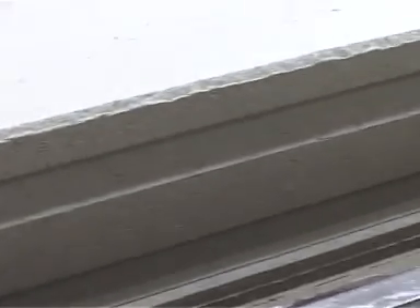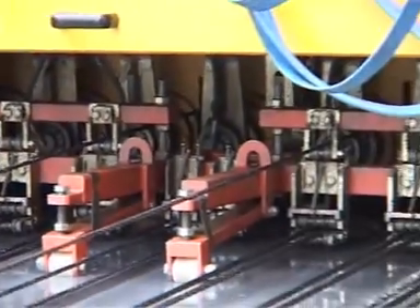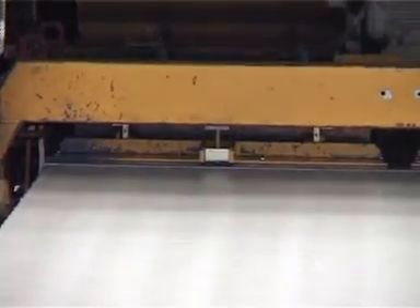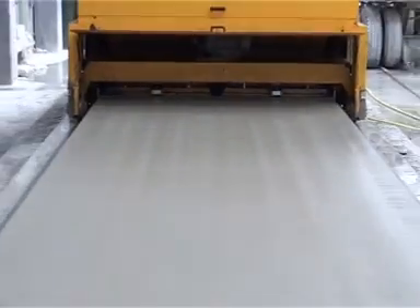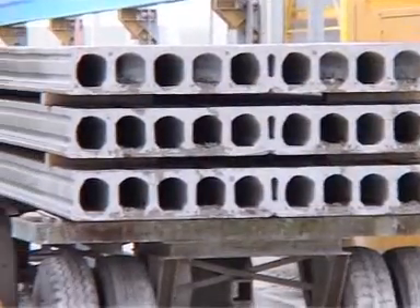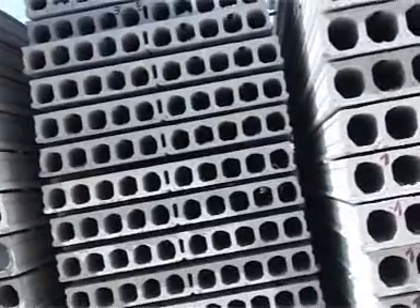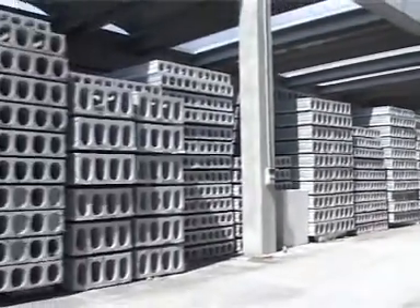The final product has excellent technical characteristics and a good finish quality in both standard production widths of 1.2m and 2.4m. The Nordimpianti duo system extruder is, without a shadow of doubt, the state of the art in this technology. In response to customer demand for even higher production levels with ever more cost efficiencies and simplicity of operation, Nordimpianti has lived up to the challenge. The duo system extruder can produce single panels of 2.4m in width or two 1.2m wide panels at the same time, and both single or double versions can be up to 500mm in height.